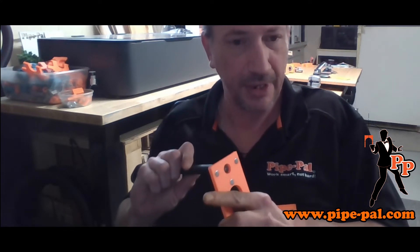So now I'm going to talk about the laser system. The conduit spacers have a hole right here, and that's for this right here — a very inexpensive, very visible green laser. Green lasers are great because the eyes pick up green more than they would pick up red. You take your conduit spacer, insert the laser end with your magnets out, then take the same size conduit spacer on the other end, and you have a very effective laser unit.